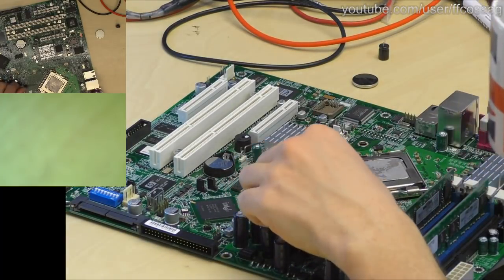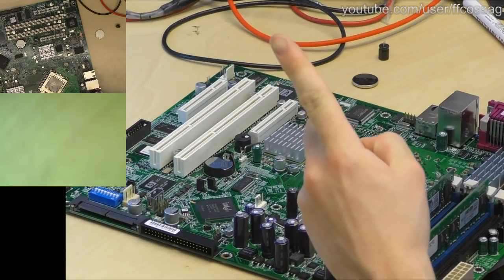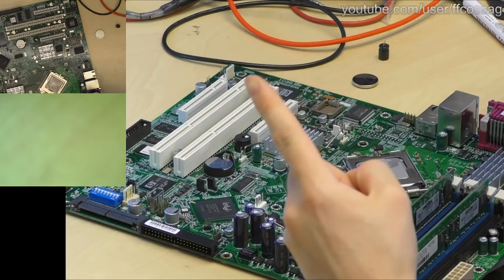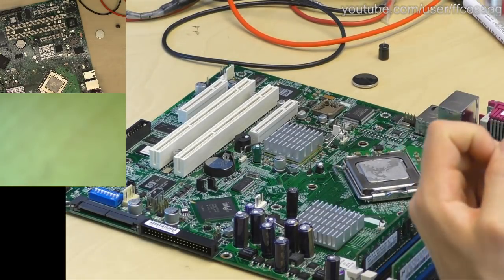Someone says, once you've recapped one MSI motherboard, you never trust silkscreen again. That is very true. I have been there. I have done that. I have seen the smoke. So I know your pain, but I did remember that negative was going towards the IO plate, and that is what we're seeing, so we're good.